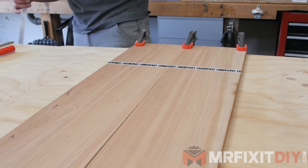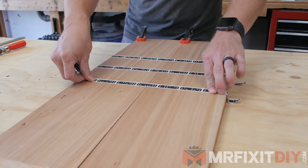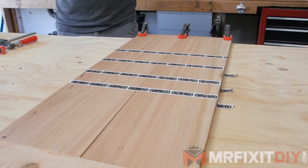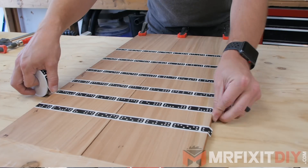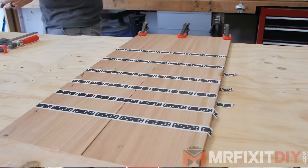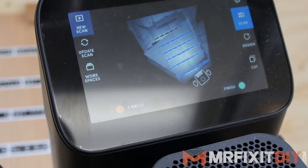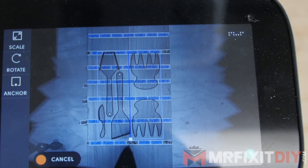In order to reference the workpiece and the shape that you're cutting, the machine uses a camera to read this domino-looking tape that you lay out around the work surface. How much tape and at what spacing depends on the size of the project you're working on. Since this is a smaller project, I needed to add the tape every few inches so the tool has plenty to reference. Once laid out, I could move the tool around to scan my work area and place the file image on the work surface to be cut out.